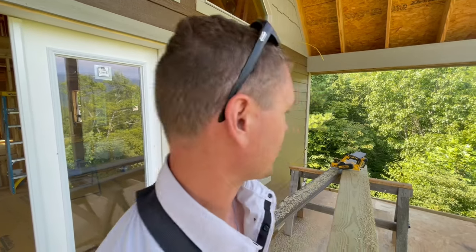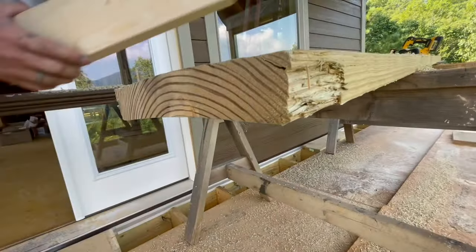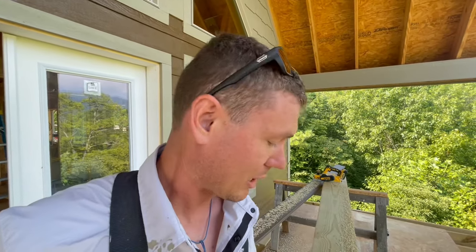Eric likes to cut me off all the time because I talk too much, so this Building Knowledge Channel is designed so I can just keep talking. Some people want to actually hear the things that we've learned over the years. Here's something you can try: if you have a board that's cupped — like this one right here, which is really cupped, you can see if I put something straight across the top — you could actually take that board, put the cup side up in the sun, and let it sit for a whole day or two. I would almost bet that it'll flatten out. Maybe we'll do that experiment.